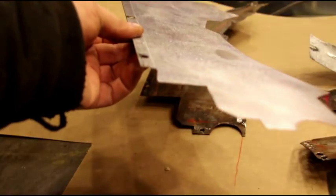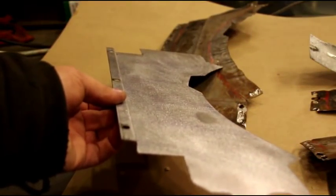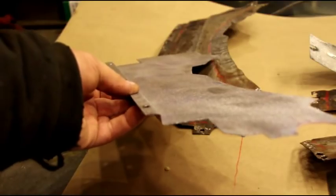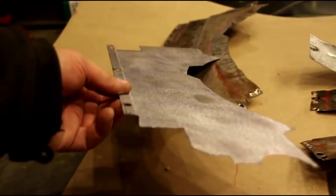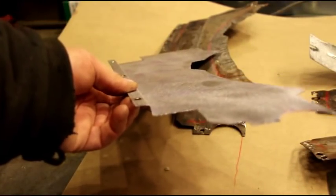And those that I was making are made out of ultra high molecular weight plastic, and they have incredible strength, and you can use them for press brake dies and a lot of other hammer forms and things like that. They last for short runs, and you could do light sheet metal. I've done some 18 gauge bends on that without any trouble.